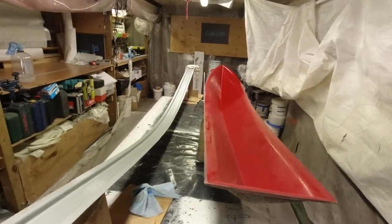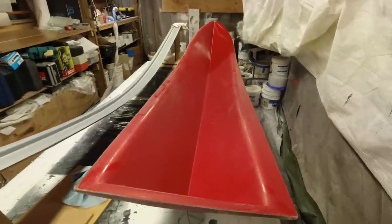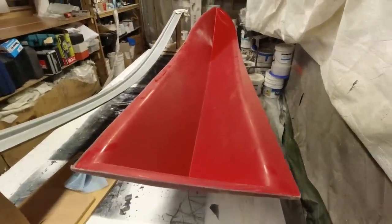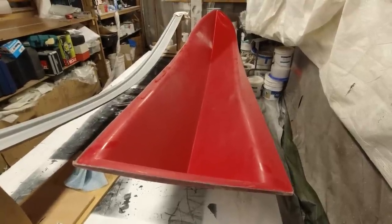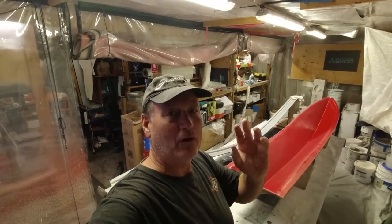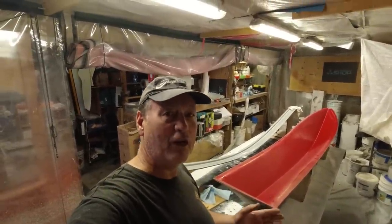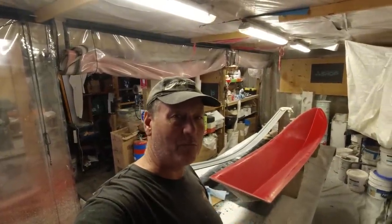The other thing I have here is the wave breaker that Janet's been doing. I'm going to put at least one of these underneath our bridge deck because we've got a solid bridge deck, and potentially a second one as well, in order to break up the waves going to hit underneath the deck. We certainly want to try to reduce slamming - we've got 1.2 meters of bridge deck clearance, however we do know this boat has a little bit of slamming, nowhere near as bad as some bridge deck catamarans.